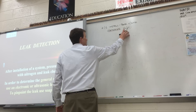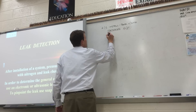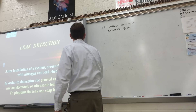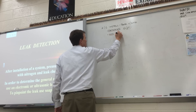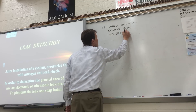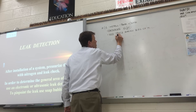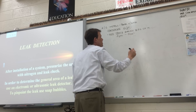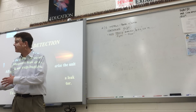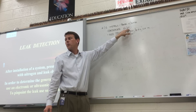Let's say you look at the data plate, pressurize with nitrogen, nitrogen drops down — you see it dropping, what does that mean? You've got a leak. So what are you going to use to find the leak? The best refrigerant you can add to make the electronic leak detector go off is R22. You're going to add a trace amount — somewhere between 2 psi to 10 psi of R22 as your trace gas — then back it up with nitrogen pressure up to the data plate's low pressure rating.